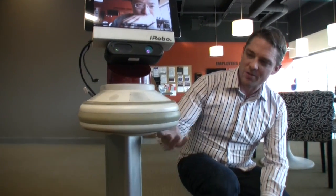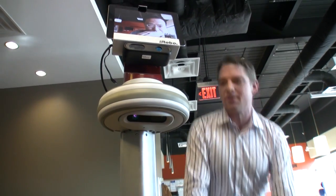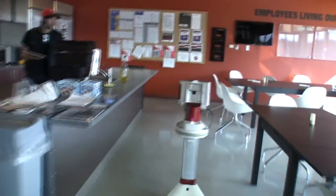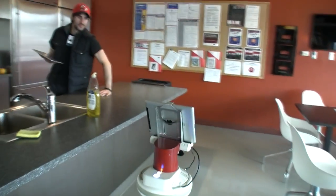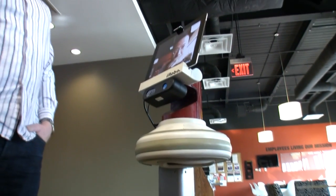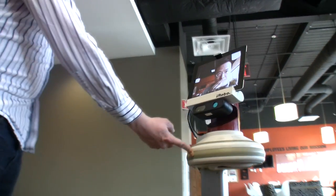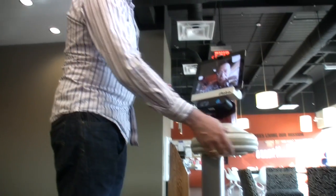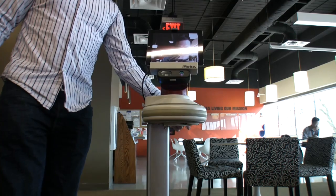Moving up, we've got this vertical articulation on the platform. This lets us have interactions with someone standing or someone seated. We also like to get her nice and low when driving so we can get a low center of gravity and maintain human walking speeds. A very quick tap and she'll turn and look at you — very similar to tapping somebody on the shoulder. A longer push and hold is kind of the 'get out of my personal space' thing. And if you pinch the up and down buttons together, she'll do a rotate-towards-center feature.